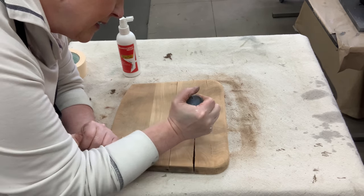Now it took me 3 coats to cover. I'd rather put thin coats on, let those dry completely in between to get that nice finish. So now I'm finishing up and sealing this paint in with some polycrylic. Now I'm going to pull off the tape and do any cleanup around the black that I need to. As you see, it's easier for me just to paint the bottom of these, freshen that up with a coat of the Waverly chalk ink paint and seal that in with some polycrylic than trying to go with 3 coats of white.